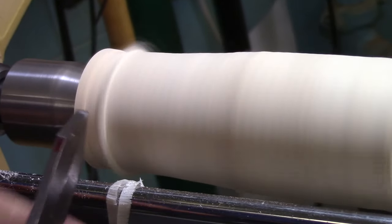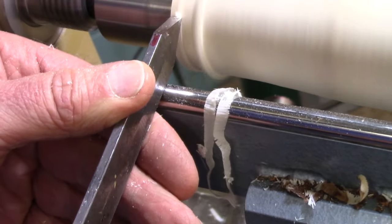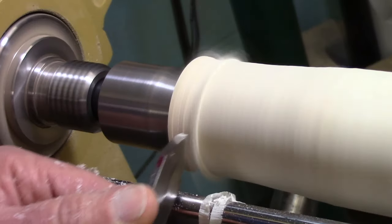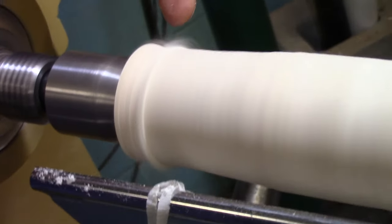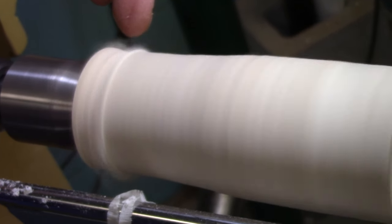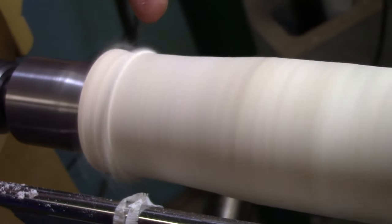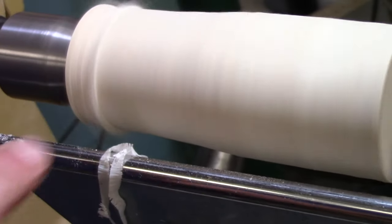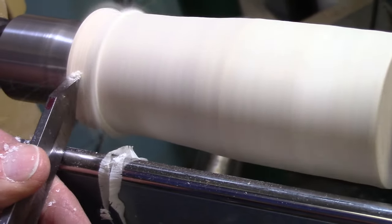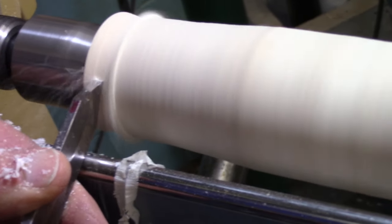It's never a good practice to use the parting tool and skate across the top. It may seem like I'm kind of skating, but I'm just using light touches and blending. And where am I looking? I'm actually looking on the top back of the object. That's going to tell us the results of your profile, of what the tool is actually cutting. If you look here where the action is, what you're seeing is chips, and that's not going to tell you a whole lot with regards to the finish line, where you want to end up. So, nice light touches.